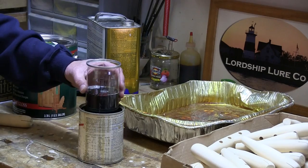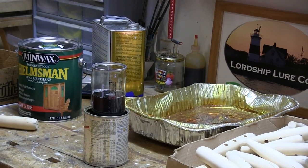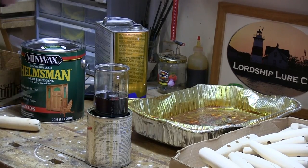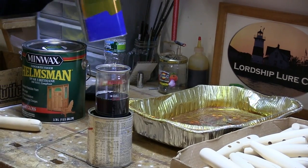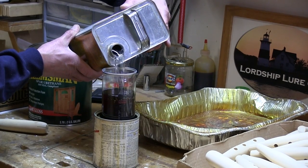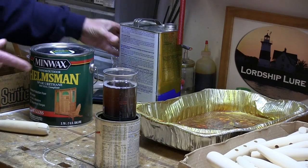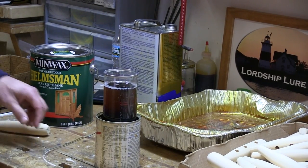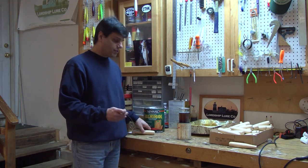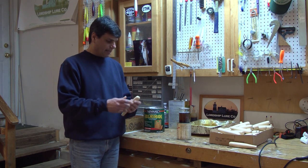What I'm going to do is cut this with mineral spirits. I don't have a set formula — I kind of like to go by feel. I would say the most I do is maybe 25%. So I'm going to pour in some mineral spirits. Keep in mind the more that I cut this the less sealing power it's going to have, so I just want to make it thin enough to penetrate the end grain.